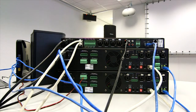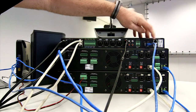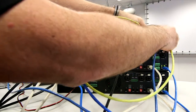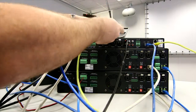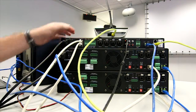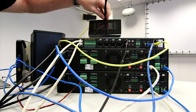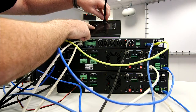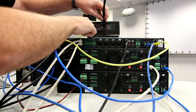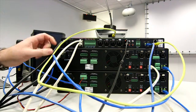Connection for the call stations and wall panels is quite simple. On the rear of the unit there are two RJ45 connectors — that's for the loop-through or daisy chaining of call stations. One port says control panels and the bottom one says call stations. We connect the call station to the connect port. Once we power the system on, the unit does a little search via RJ45 to find what units are out there, and then we can see it powers over Cat 5 — no problem. Capacitive touch, very nice. So that is the call station.